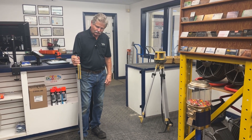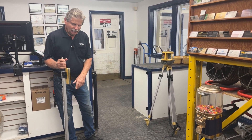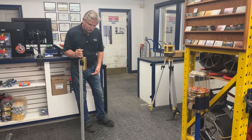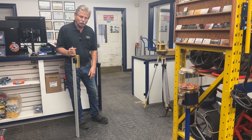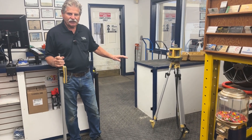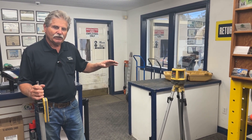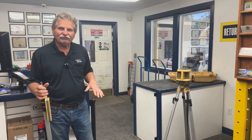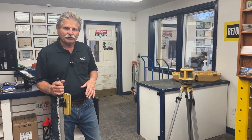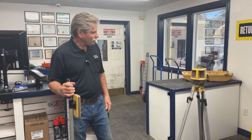It's fairly simple to use, but be aware that it's opposite to the ground — if you lift the receiver up, you've got to lift up what's underneath, and if it's going to go lower you have to dig out and go down. Make sure the tripod never gets kicked. On this particular model, even if it gets touched a bit it'll stop and reset itself to level, so you're never going to be off. Some models may not do that, so be aware you don't want a beam that's gone off-level while you're checking everything.